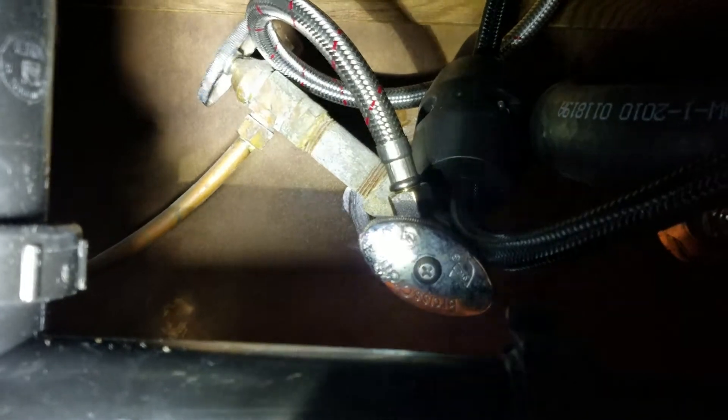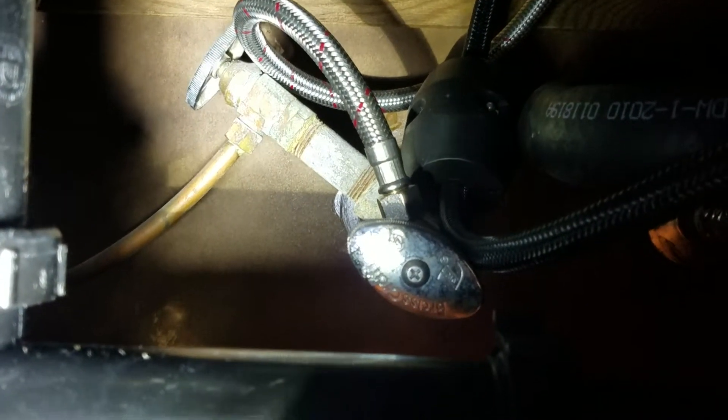This side for some reason had a multi-turn 3/8 and then another multi-turn 3/8 for the dishwasher. We haven't worked on the dishwasher — I don't know if that shutoff valve is on or off. I wouldn't recommend using it. The hose has collapsed and kinked down here, you can see that. So I'd wait for the new dishwasher install and just wash them by hand for a little bit.